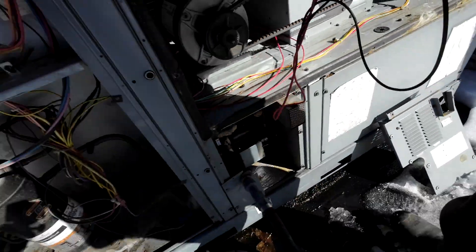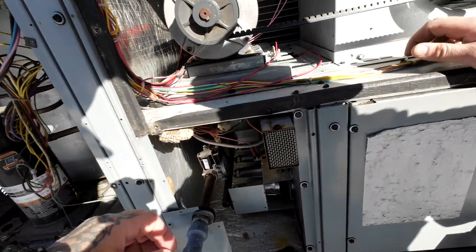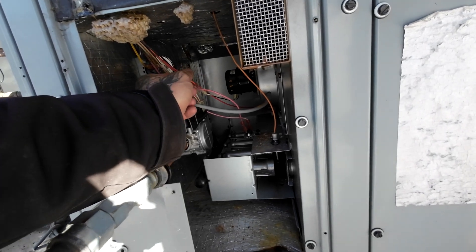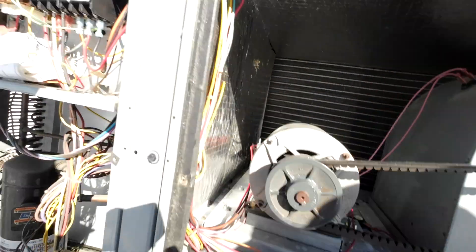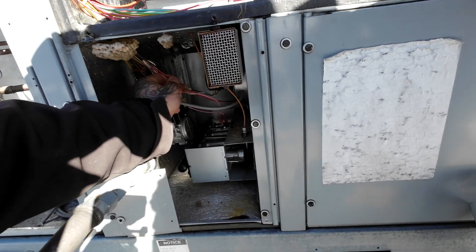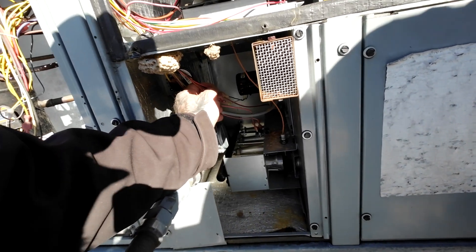That's good - that's another issue. So next, what we have to do is find the power and do some more, see what's going on here. Look at this orange wire - this goes all the way back. We're going to open up these two right here, put a meter here, turn it back on, and go between black and orange to see if we get any voltage.